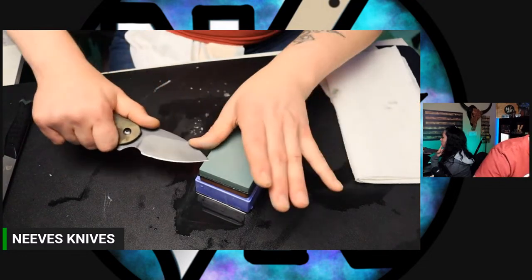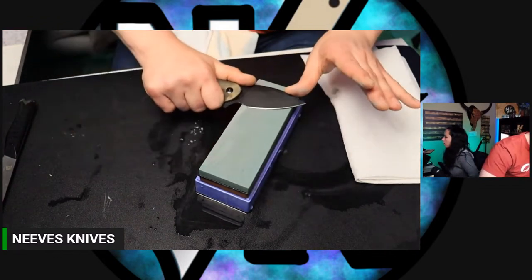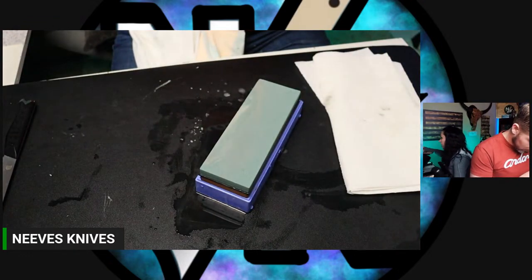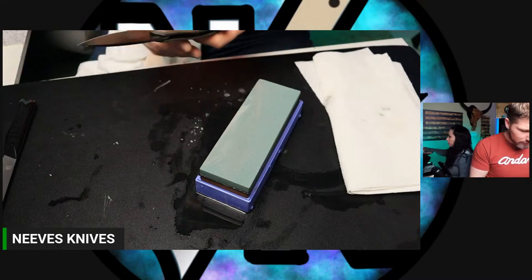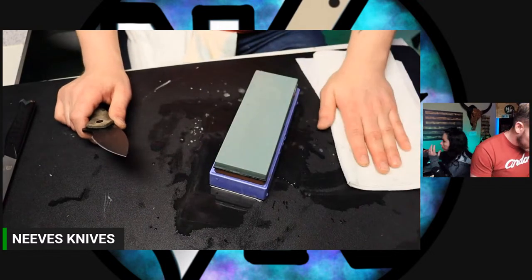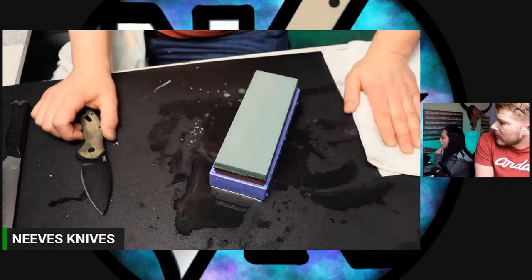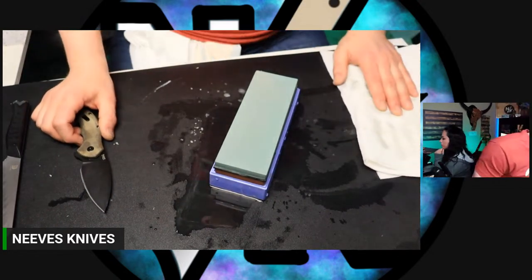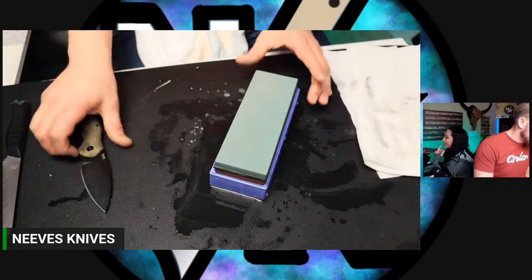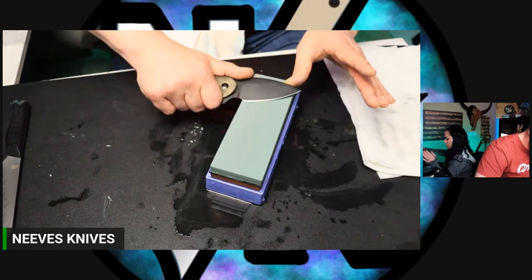Question. Lauren69 says, waiting for my new Migron Akri based on your video. Any advice on angle and grit? The Akri, A-K-R-I. Hold on, what knife again? Would you read it again? Angle and grit, what's your suggestion? Here, I'll show you the knife. The Migron Akri. That one's in 14C28N. So 17 degrees per side, and then you can go up anywhere from 600 to 5,000 grit.